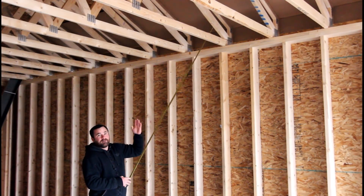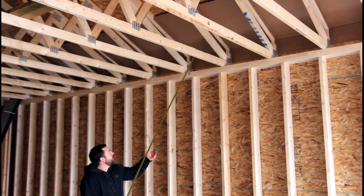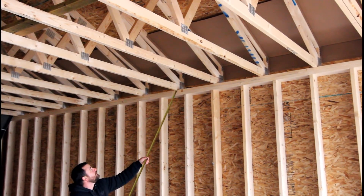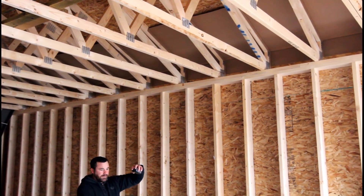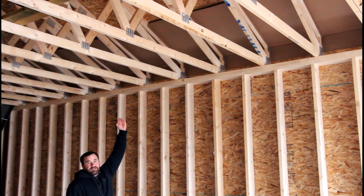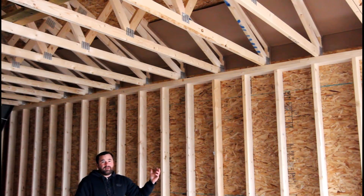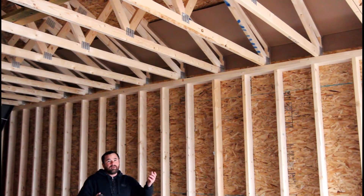You want the stops as far out as possible to give you maximum insulation but not so far that insulation falls out into your soffit. These nice big 44 inch long stops go up nice and high — those long stops are ideal because then you can get an R50 or R60 blown in and still have lots of coverage, pretty much 20 to 24 inches deep. The other thing those stops do is if you're in a windy area, you want them nice and high because wind can get up in your attic and blow the insulation around, creating hollows.